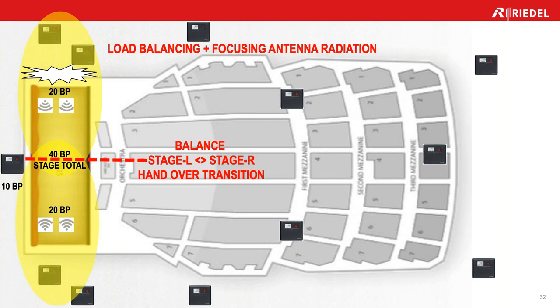Like you said in the earlier example, you might have an antenna group that's backstage in the dressing room area. You might have another one that's in stage left, et cetera. But it's really all about, if you're going to change power level, you've got to do it with the whole antenna group. What happens if you only change half of them? Well, you can't. You can only change the entire logical group. Oh, it's not an antenna setting. It's an antenna network.